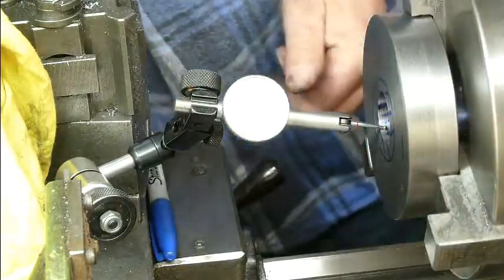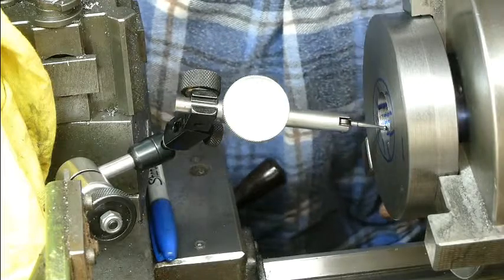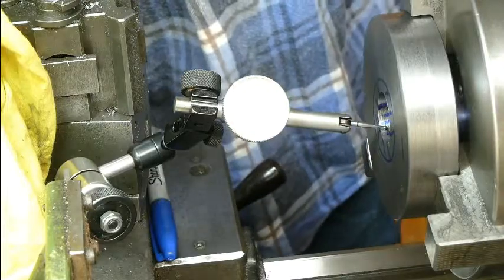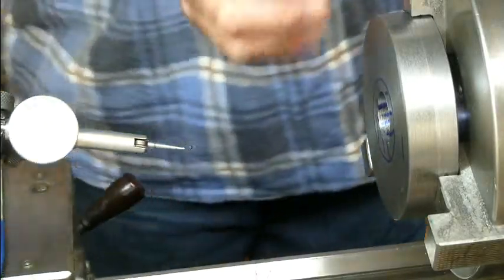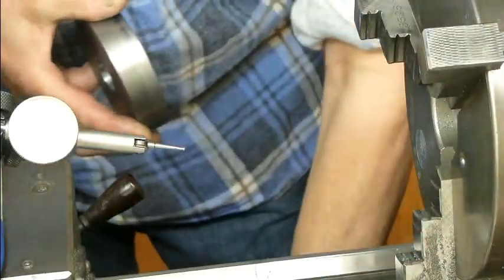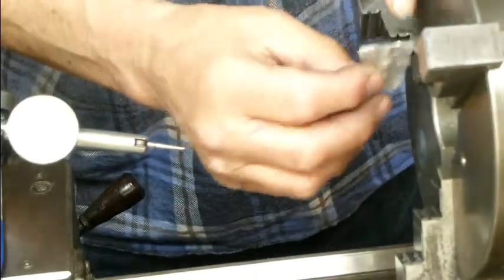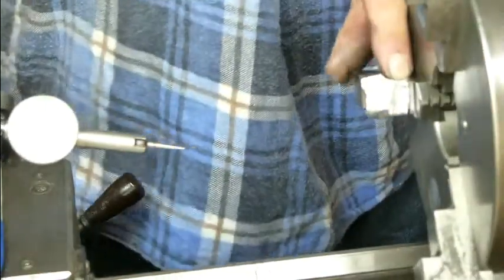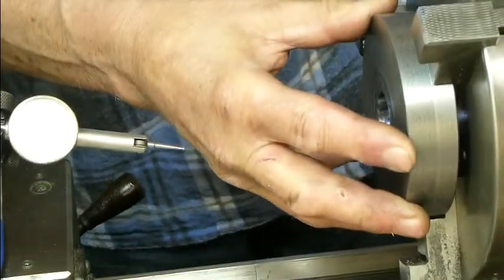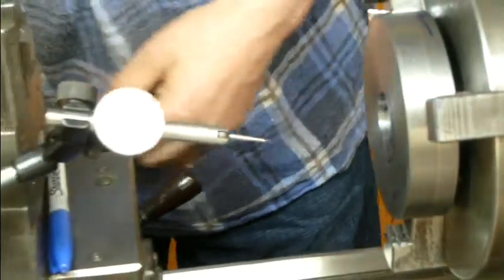The low spot is there. Right, so it's still low by about 0.05 millimeters, which is about 1.5 thou, so I need to double the foil thickness because the low spot was in the same place. Unfortunately it's aluminium foil, which is probably a bit soft.